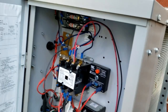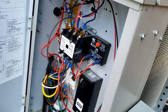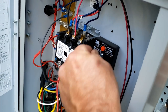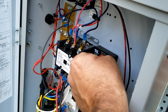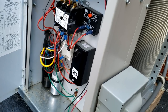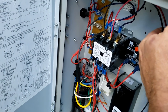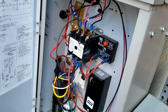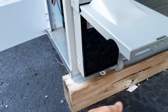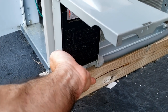There's a little timer here so it doesn't short cycle — when this thing pumps down and shuts off it can sometimes rise up and short cycle. It's set really low at 0.3, basically nothing. You can go up to maybe 5; you don't want to go too high though because then it lets refrigerant come back and migrate to the compressor, which isn't good. They've got it grounded using solid core wire, and he actually bent it around the terminal — you don't see that often. Let's get the refrigerant charge set first and double-check everything when done.